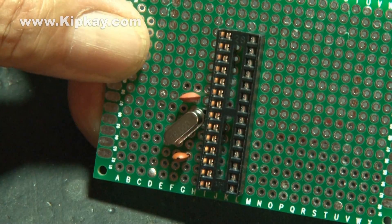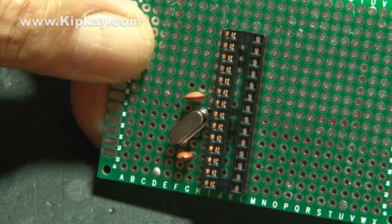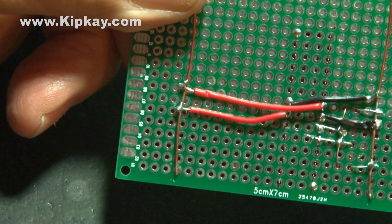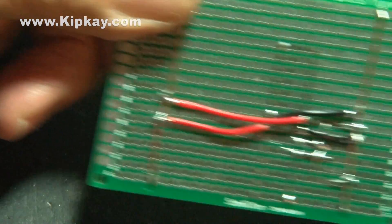I had to think smarter and was actually able to minimize wires when I could put the components semi-close to one of the ground rails and use resistor pins to connect directly to the chip pins in certain steps.